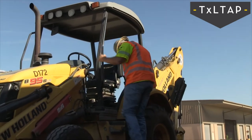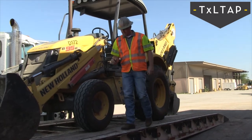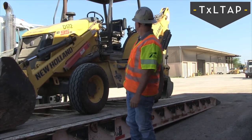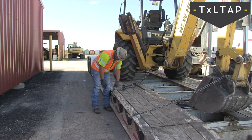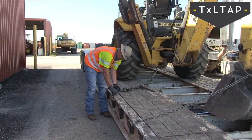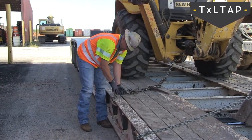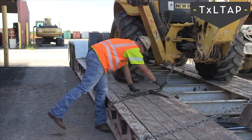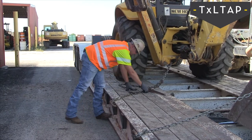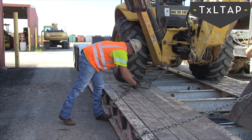Always use three points of contact when climbing on the machine. When climbing off the machine, remove the key and put it in your pocket for safe storage. Make sure your chains and hooks are tight before you start, ensuring a downward pulling force on all hooks on both sides and also on the binder. Keep all your slack to one side to keep everything tight and organized.